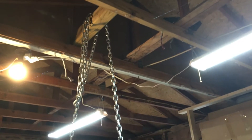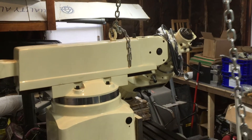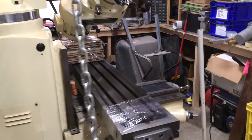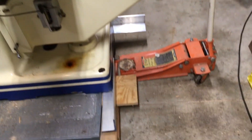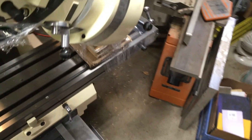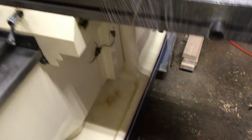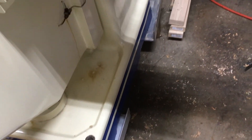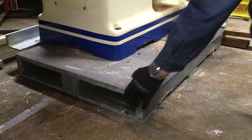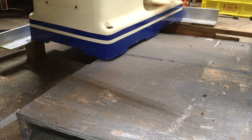We're repeating the successful trick with the car jack. As a precautionary measure I ran a chain up from the machine's eye bolt to a ceiling beam. I'm sure if the machine were to fall it would probably pull those flimsy roof truss 2x4s with it and possibly bring the whole garage down, burying me under — a dark prospect. But I did it anyway just in case; you never know, it could also save my life. The mill is front heavy, and having it on three temporary supports made it possible to slide the pallet out from under.